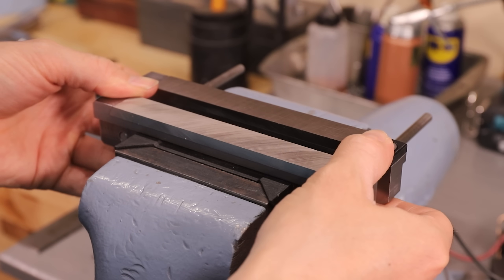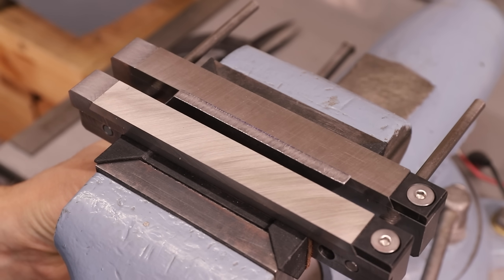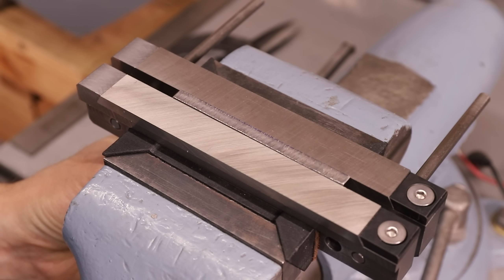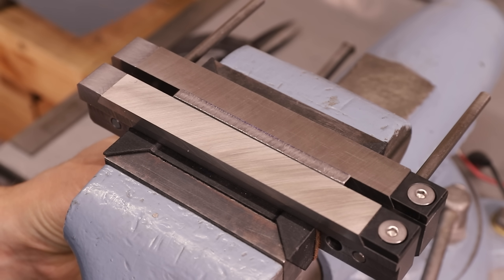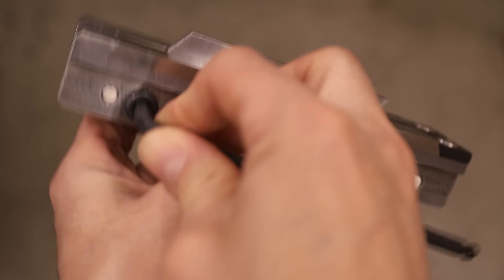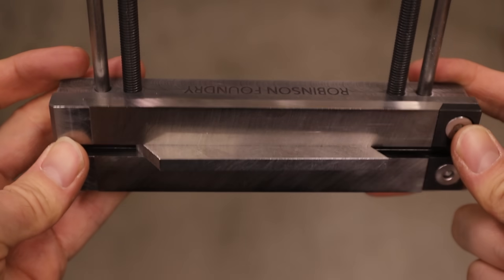This file guide design is different than any others that I've seen, because it fits onto vise jaws and it has springs that force it open. This allows for easy repositioning of a work piece, versus having to loosen and tighten bolts every time. But of course I added bolts as well, so it can be used outside of a vise. It's also quite a bit larger than others that I've seen, at about 6 inches.